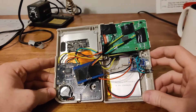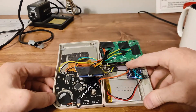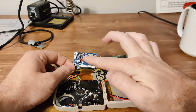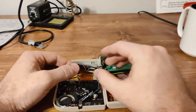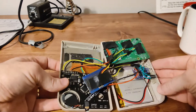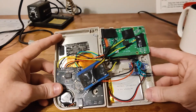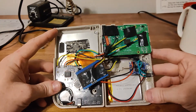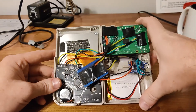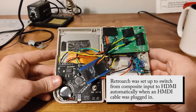This is a removable connection, so you can just pull out the battery and put in a new one. These are the two buttons in the back. This is the circuit board for the screen, which is just kind of floating in the middle of space. This is a car backup screen, and the reason I went with this was because it didn't use the HDMI port — the idea was that I could keep the HDMI port available if I wanted to plug this into a TV and play it with an external controller.